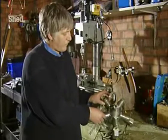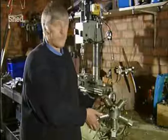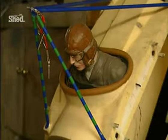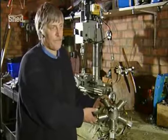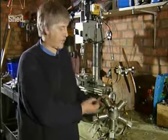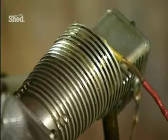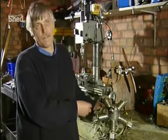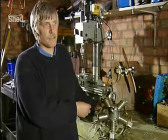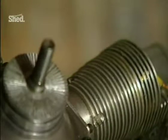This is the second model that I made. It's a five cylinder four stroke radial engine with glow plug ignition. It was built with the intention of flying this large model here. This is quite a complicated engine to build. The crankshaft is very simple — no more difficult than a single cylinder crankshaft. However, the more complicated things are the connecting rod — the master connecting rod which has to carry four slave rods — and also the valve timing equipment. It's quite complex. I think it's 11 gears that drive the camshafts on this engine.